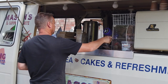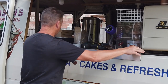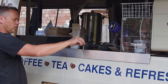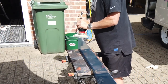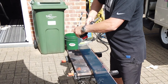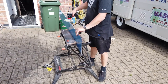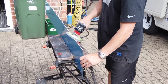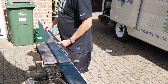Quick clean up with the Dyson. Now let's move on to this piece of 3mm plate. I'm going to get the DA on there - it's great with a light grit on the sponge just to take off the sharp edge all the way down. It's quite a quick way of doing it rather than using a file and the finish is much smoother. I'll just whizz that along and get rid of all the sharps. Then we'll get that piece of angle and line it up to the back of the plate.